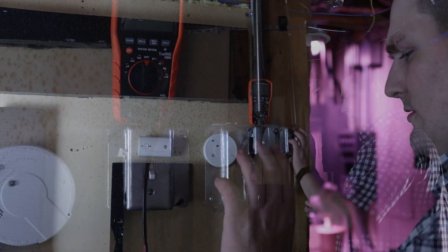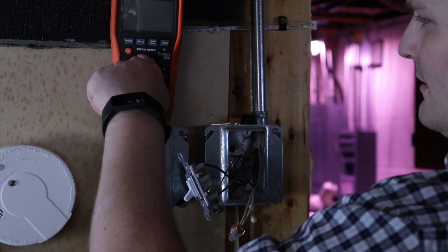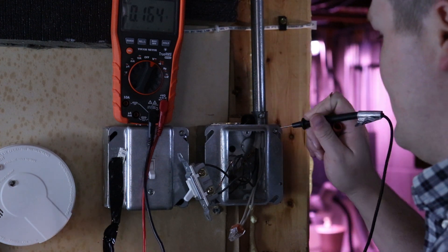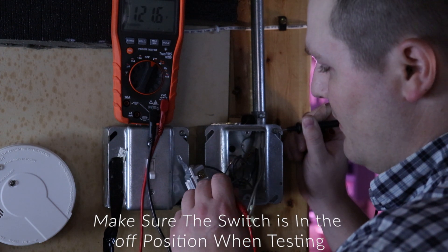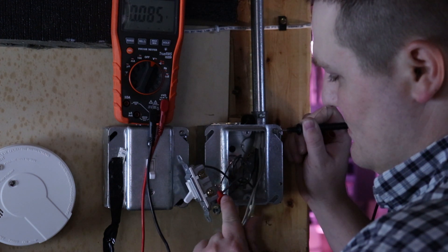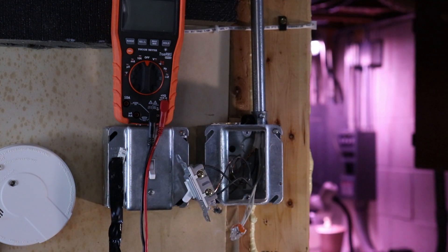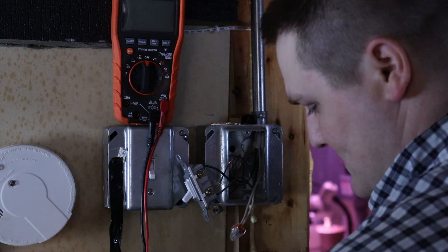So now we're going to have two different sides. I'm going to turn my meter to AC voltage. This box is grounded back in the panel to the neutral — not in the sub panel, but in the panel. So I'm going to touch the first one — we got 120. Touch the second one — we got nothing. So this is our load line going to the light, and this is our power line coming from the panel. This is the one we want.